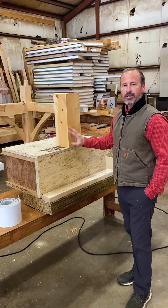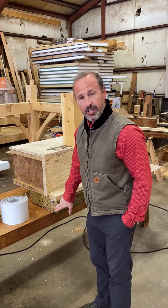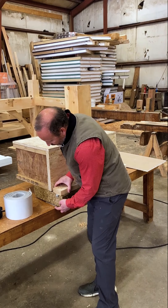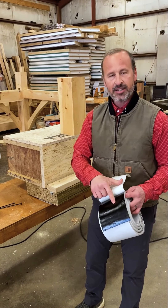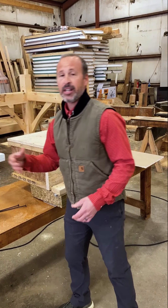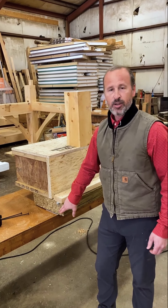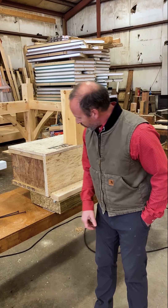Today we're going to show you our most typical detail that we use when we're building a timber frame. What we have here is a pressure-treated sill plate — a PSL, parallel strand lumber piece that is pressure treated to prevent rot. The sill is sitting on top of our favorite sill seal, made by Protecto Wrap. It has a backer on it and sticks to either the top of the foundation or you can pre-install it on your sill plate. What we like about it is that it does stick, so you get a good airtight seal, and it's also very thick — about three-eighths of an inch. So if you have an uneven surface on the top of your concrete wall or an uneven sill plate, that three-eighths of an inch really does take up that gap and prevent air from leaking into the house at this vulnerable point.